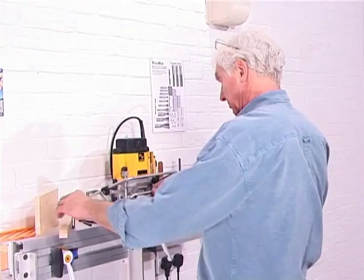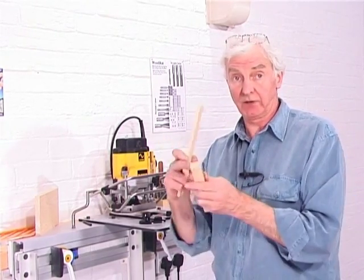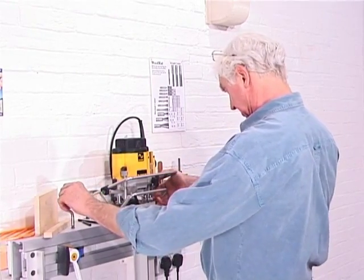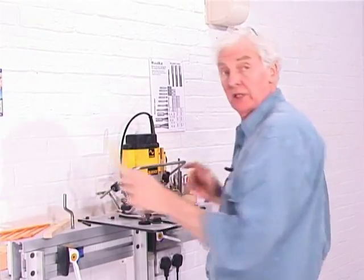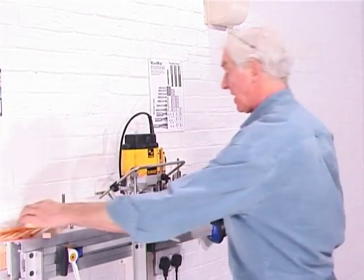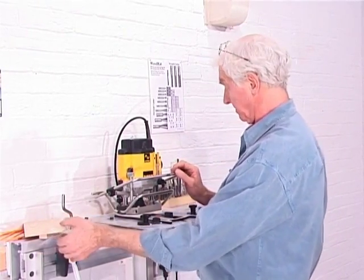The dovetail starts with a test stick. From a squarish section, I've bandsawed off a thin slat, leaving a thicker part. Take the thin piece. Zero the cutter onto the top of it, and using the end piece, depth the router by putting the piece underneath the depthing foot, between the depthing foot and the base. And now, as you push that away, drop the cutter, it will be depthed exactly the thickness of your end.